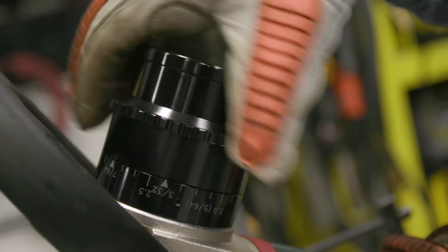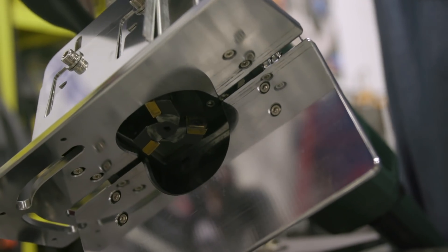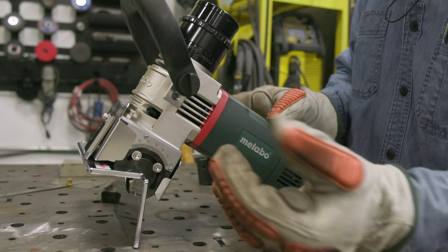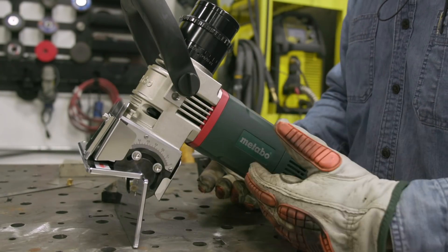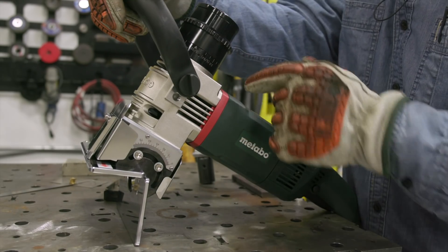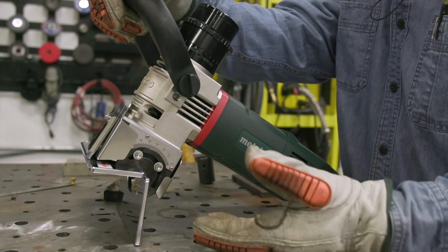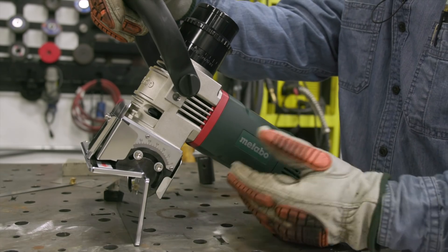With this dial up here, I can simply raise and lower the cutting attachment on the inside — that's what's going to allow me to improve my accuracy, because I can actually dial in exactly how much stock I want to remove with each pass. Now this is all in metric, so my friends across the pond are going to love that. For standard users, we have to figure out the metric equivalents — about 3 millimeters equals an eighth of an inch. So for a 3/8ths plate, you can actually set this to 9 millimeters and take it all out in one fell swoop.